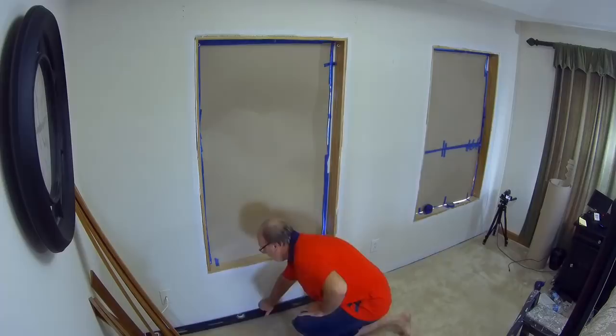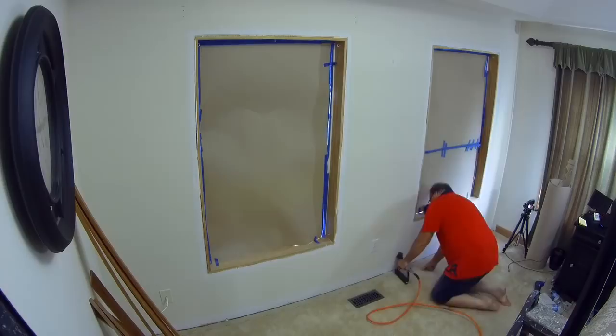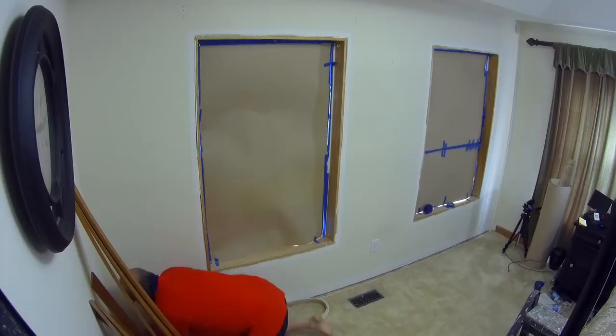What I'm doing here is drawing a line that's two and a half inches from the wall, and I'm stapling down the carpet about every three to four inches so that I can remove a two inch strip. The purpose of this will become apparent in just a second — it's really important to do this. Eventually we'll replace this carpet and the staples will become unimportant; they'll be able to remove them easily when we re-carpet the bedroom.